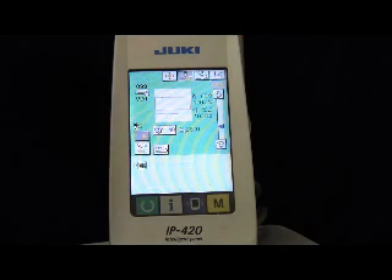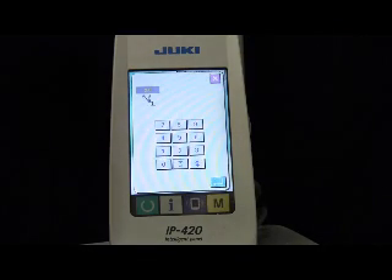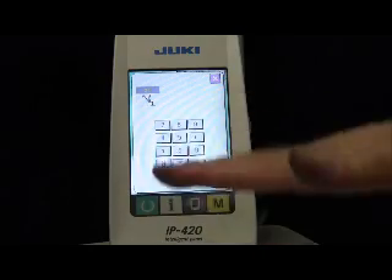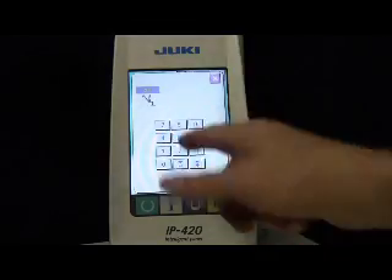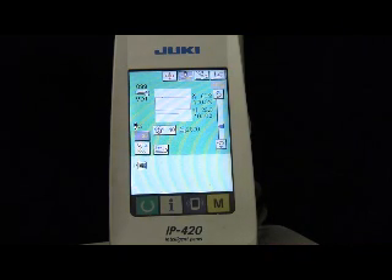When you're running the jump foot, one other thing that is kind of cool is instead of going in there and taking the screwdriver to raise the foot up and down, you can change it electronically too. In the sewing mode, push this little picture of the foot — it's showing you the height right now, it's two millimeters. Let's say the step was really thick and you wanted the foot not to be down so high — you could easily change that. As you press this, the presser bar goes up. You can change this at different spots when you're writing the program too. It's kind of doing the same thing as raising or lowering the presser foot bar, except you can do it right on the panel, which is pretty neat.